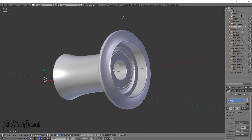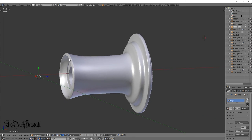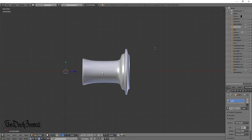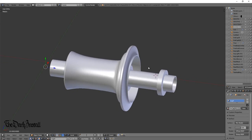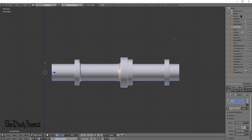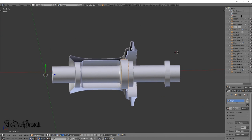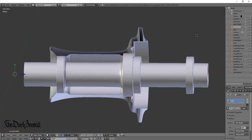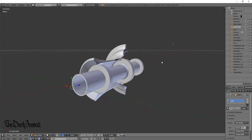This side is the non-drive side flange, which is a straight pull system. In perspective view it's looking pretty nice. Let's put the axle through and the two bearings. Since you can't see inside with the full shell on, let's switch to the cutaway hub shell — that's just cut in half down the middle. It looks hollow but in real life it'll be machined out of a solid bit of metal. You can see how it works with a series of shoulders machined in.